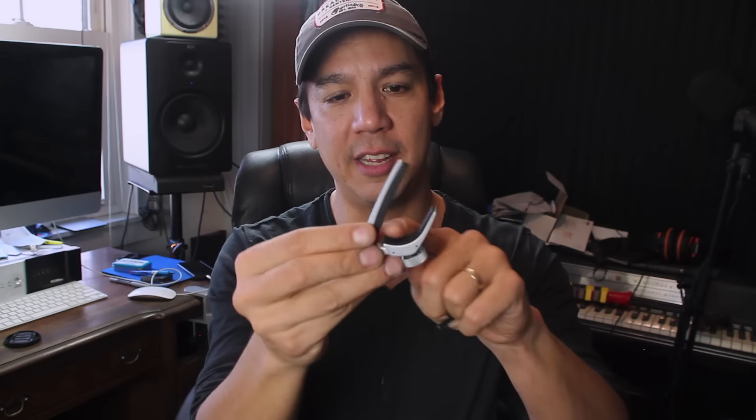But what I do have — and this is just me being cheap and relatively creative — I have a couple of capos that have adjustment knobs. There's a nice rubbery part on here, so when I press down on the fretboard it won't hurt the wood. And it does have a nice arc in the back, which should accommodate the radius of the back of the neck perfectly fine. So I'm going to use these for clamps and my good old syringe of glue here.